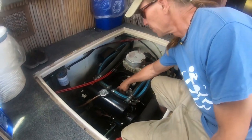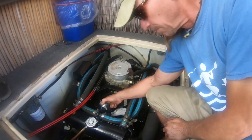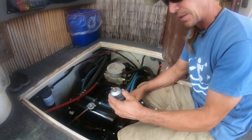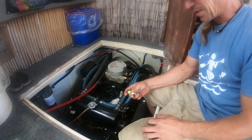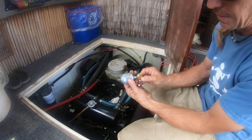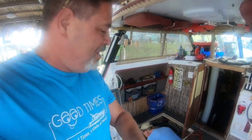The reason is there's no room for that. If this were underneath here like that, high enough to miss that little gusset on the intake manifold, this would be hitting the bottom of the distributor. So that's why we have to do an angle. And that thing will come off the side like that. Perfect. And yeah, that's all we need. This was pretty much the last thing holding us up, and we got it this morning, so y'all stay tuned for a crank here shortly.